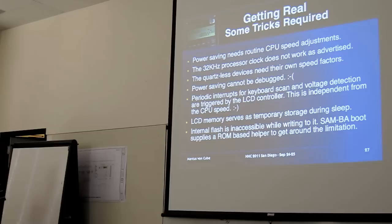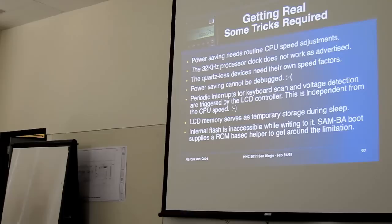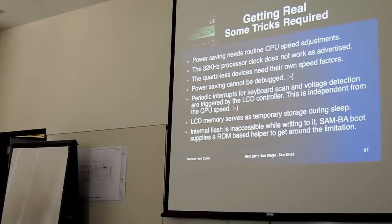And he's convinced me, or Tim has convinced me, to do it almost the same on 34S. It's a bit different, the scheme. I let it run for half a second in a low power mode before I switch it off, so I have a periodic interrupt which helps me to keep track of battery state and some. So you don't have to push a button 100 times to get a battery reading. You just have to let it sit for a second, and you get a better reading.